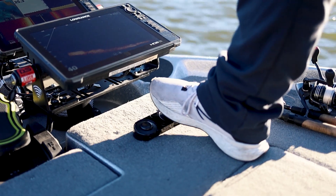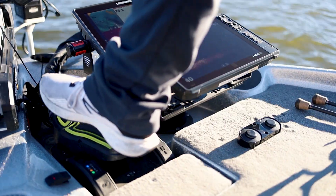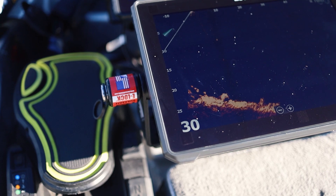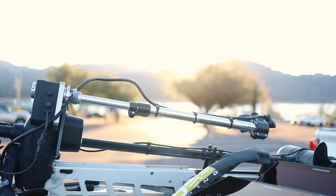This allows you to control your forward-facing sonar separate from your trolling motor shaft. The great thing about it — if you're on spot lock and the trolling motor's swinging around left and right, this product allows you to keep your forward-facing sonar on the fish, the rock pile, or whatever structure the fish are spooled up on. So no matter what angle, what weather conditions, or what angle your boat's pointed in, you're able to keep that control and see the fish.